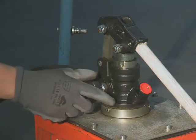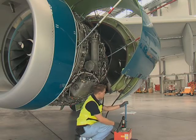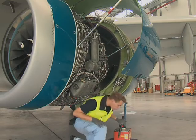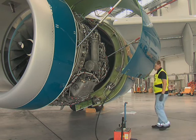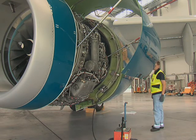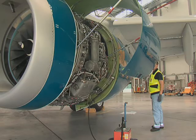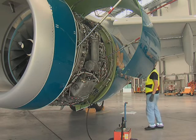Open the valve on the hydraulic hand pump slowly and let the thrust reverser half close. Caution! Do not disconnect the hand pump until the opening actuator system has been drained for a minimum of 1 minute after closing of the thrust reverser cowl. Compliance with this recommendation has proven to extend the thrust reverser cowl operating service life and to minimize leakage.